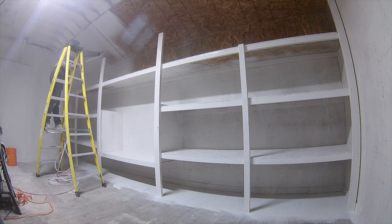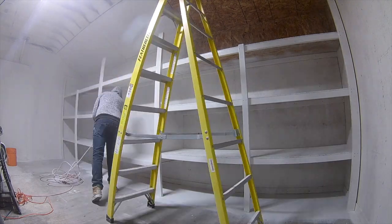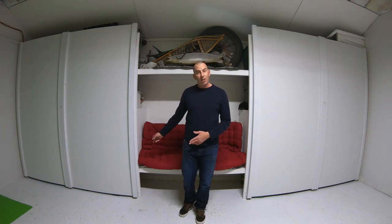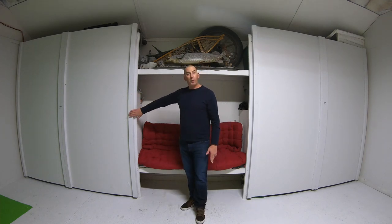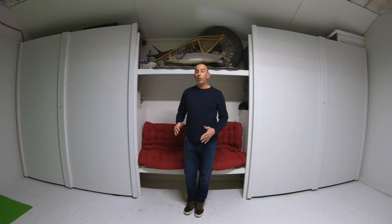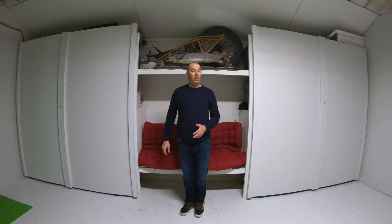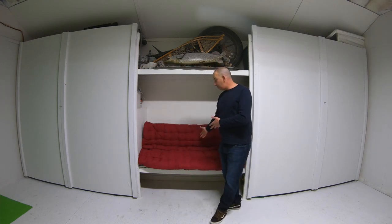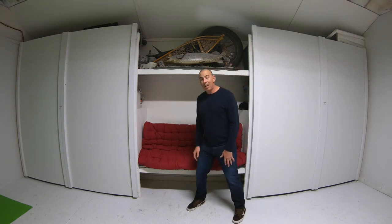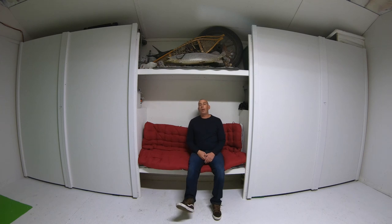I will use two 8-foot sections and one 6-foot filler section. I finished mine off with 4 by 8 sheets of OSB, added a 2 by 3 down each edge, and used two interior door hinges on the shelf supports — a nice way to clean it up. In the bench area I've got some temporary lounge chair cushions to show what the setup could be. When I'm finished I'm going to make fabric cushions, just like a restaurant booth — so stay tuned for that DIY video.